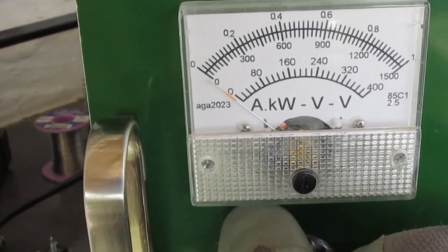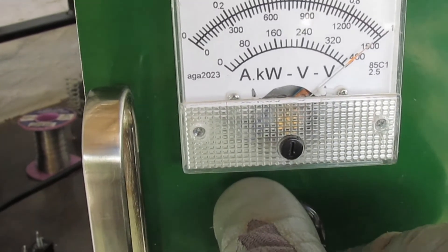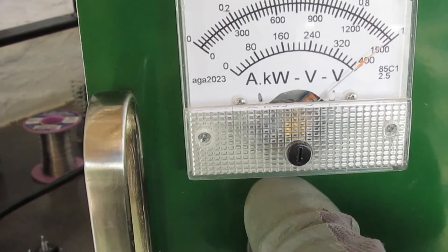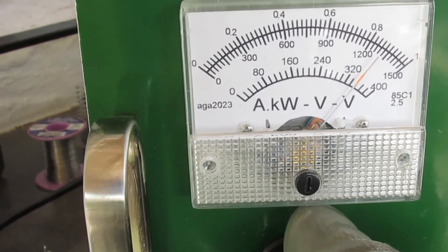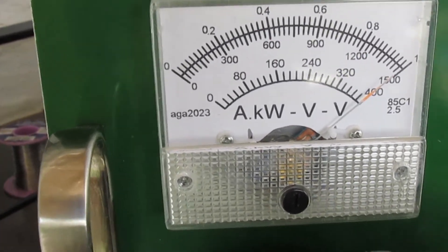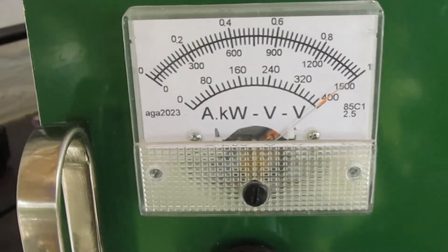Let's see what else we've got — is everything else still working? Yep, we've got minus 150 volts there — it should be minus 120. And about plus 350 volts. This is all looking good. But the biggie is that one there: 3000 volts. Job done.